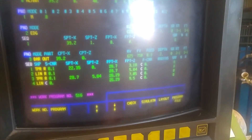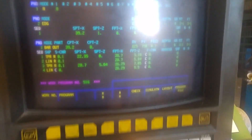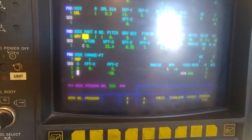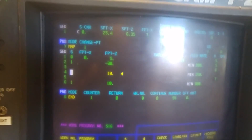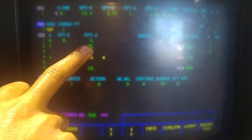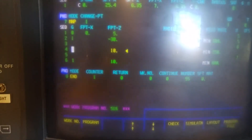A quick little video to show how my simple bar puller works. There's the manual program — all it'll do is bring it down to X0 Z5 with the speed down really slow, then it'll turn it off and feed to minus 30, so it'll shoot onto the part 30 mil.